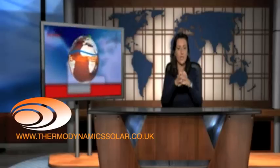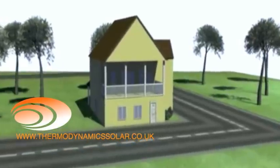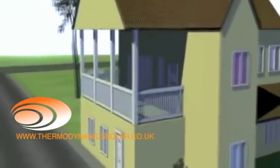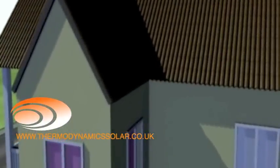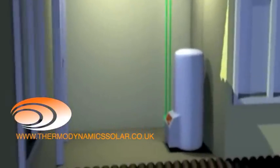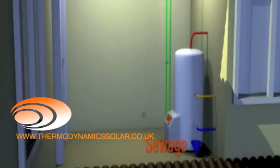Let's take a look at the preparations for installing an EcoThermo. The first step is to analyze the best location for placing the panel and the water heater, with the priorities being the best orientation and tilt of the panel, the minimum distance between the panel and the water heater, and also at the side where the water heater is to be installed there should be electrical power, a cold water source, a hot water outlet, a pressure relief point, and a sewage connection.